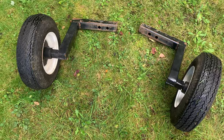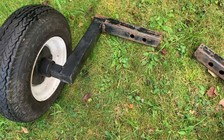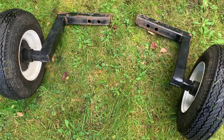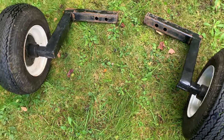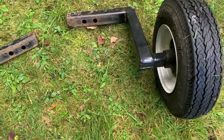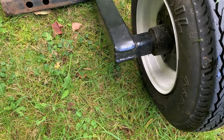Here's how everything fits together. I'll have a diagram in a moment with some measurements, but here's the general idea. You're going to take the square tubing, cut it up, weld it into some 90-degree angles, and drill a hole in the top for the pin to pass through. Mine has two holes just because I was playing around with placement, but you only need a single hole. At the bottom of the square tube I cut out a slot, put the hub spindle in there, and welded that in place.